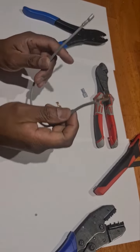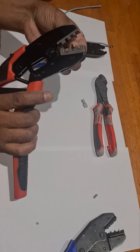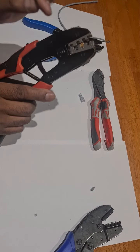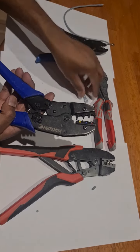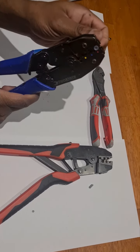So that's how you do an open-ended spade and a fully insulated spade. The tools required are an open-ended crimper with curved jaws — when you place a terminal inside the jaw it starts bending it towards the profile when closed. Then we have these type of crimpers which have a specific jaw pattern designed to suit the round terminal.